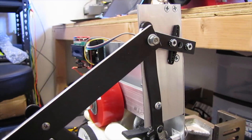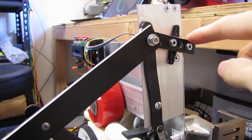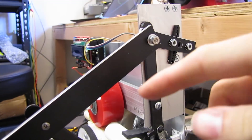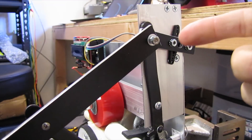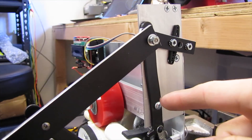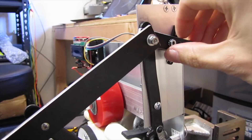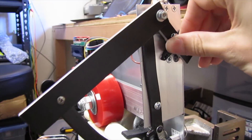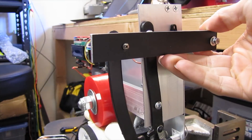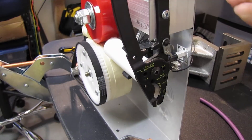This is the servo linkage. I took a high torque servo and put a little arm on it. Originally this was a piece of wire, but the wire was a little stretchy. Probably would have worked with steel wire, but then I would have been fighting the spring built into these cutters. So I removed the spring and just did a solid linkage with a scrap of aluminum. The servo moves almost 180 degrees in order to complete the cut, and that closes the jaws of the cutter all the way.